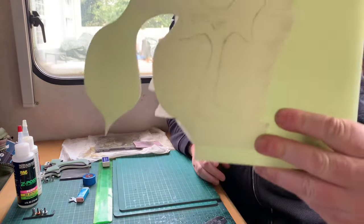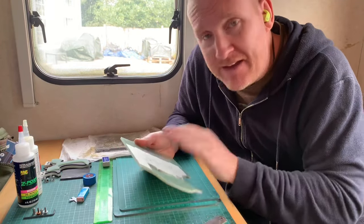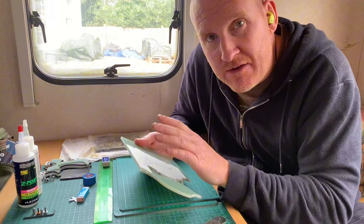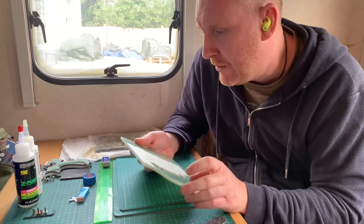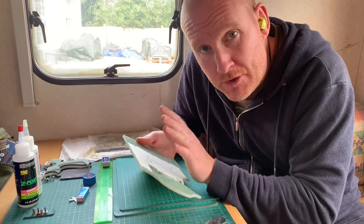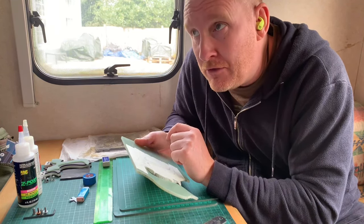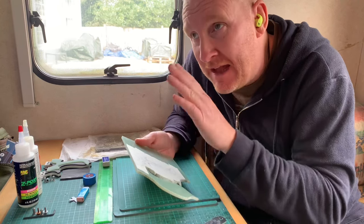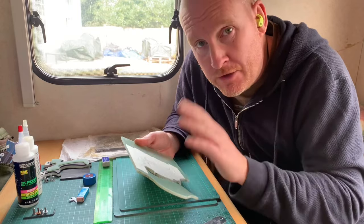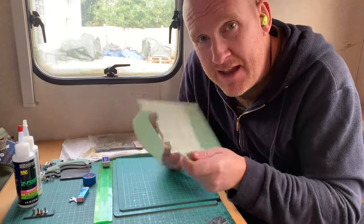It's all drawn up on paper as a template. The next step will be to cut this out and use that as a template for the next layers of the build. I've also included a little bit of complexity on the core just to show how I'll work with that. I'm looking for 85mm outer width but I'll probably cut this to about 86mm — that allows room for shaping down and sanding. You can always take off but you can never put back on. First stage done — let's get cutting.